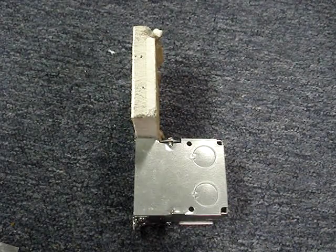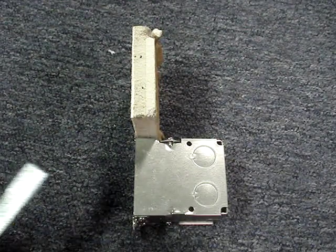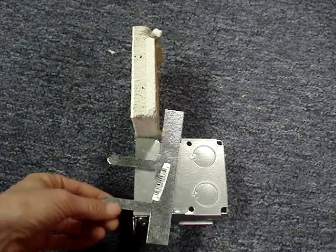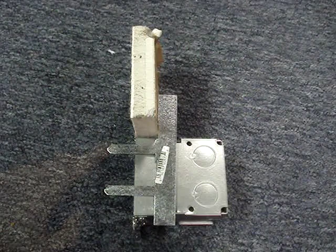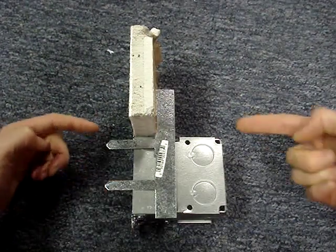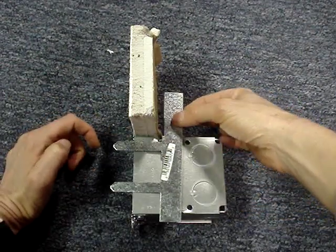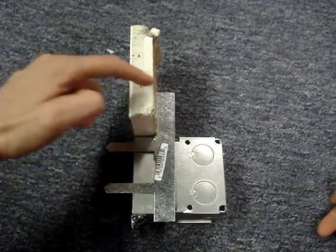In most cases, it's easy to install an old work box. The box is inserted into the opening in the drywall, then two old work box supports are slid beside each side of the box. The straps are bent around the sides of the box, and it squeezes the edges of the support and the plaster ears between the drywall and the box, and clamps the box to the drywall.